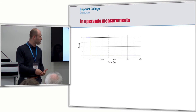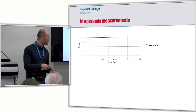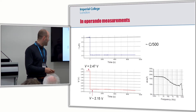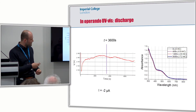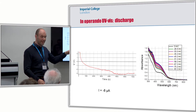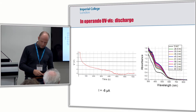When we apply an electrical measurement to this device, in this case I'm applying about two microamps discharging current, which we estimate should be something like C/500, but there's obviously an error bar on this number. We can see that there's quite a big drop in potential, and this is consistent with what we expect, given the very high series resistance of a device fabricated like this. Nevertheless, we try to monitor the absorbance of the device as a function of discharge, and what we can see is that indeed we can measure an in-operando UV-Vis spectroscopy for the electrolyte as a function of time. We can also apply slightly higher current, but as you can see, we go even negative in voltage, which is obviously consistent with the idea that series resistance is increasing as a function of discharge.